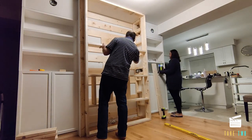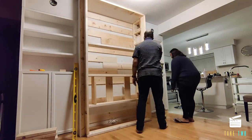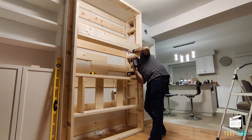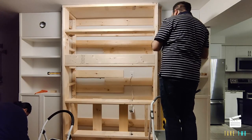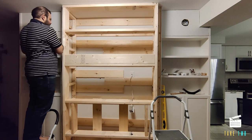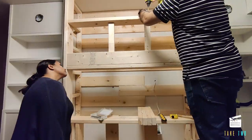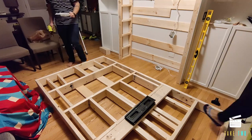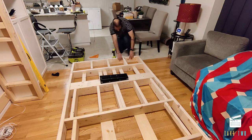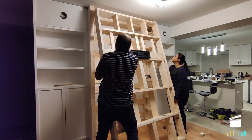Once the fireplace frame was in place we started with the TV wall mount. We had initially put the TV wall mount on the back wall but it wasn't holding, so we decided to use a two by six and attach the TV wall mount to that. For this we made a perpendicular frame or L-bracket, and also put a few two by threes at the back for support. At the end we filled up the gaps on top and bottom. The frame became very heavy but we managed to put it in place by doing a little juggling on the left and right sides.